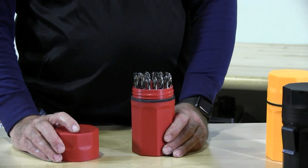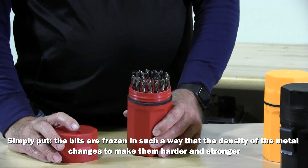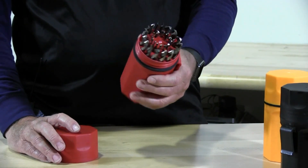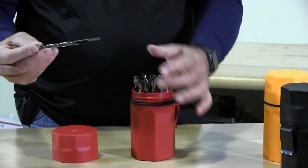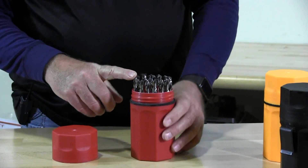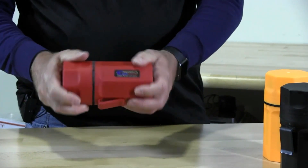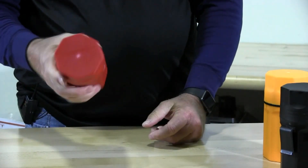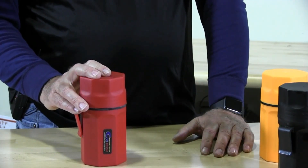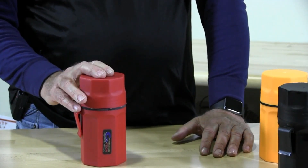The red Ultradex 29 piece set, Norseman Viking USA made, features cryogenic bits nitrated to create case hardening for extended tool life and corrosion resistance. Three flats, 135 degree point. This is the top of the line set, in the same shatter proof, waterproof, high visibility case. These are also made for hard metal drilling applications, superior to cobalt, and won't break or shatter when used at awkward angles.